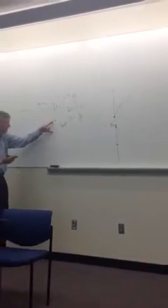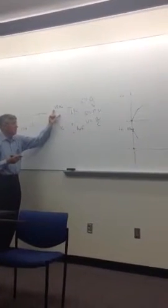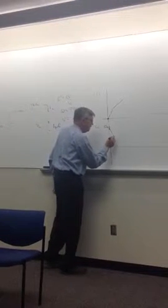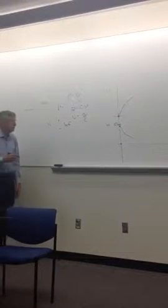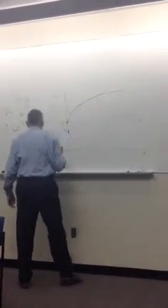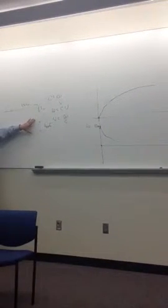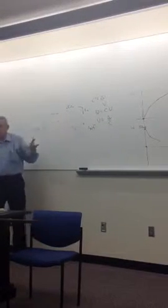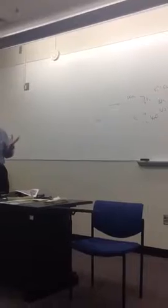But the voltage still did increase, therefore there is a decrease in the voltage across the resistor, so the current will decrease. But again, it's not going to decrease as fast. And this is going to continue on with the voltage going up until we hit 10 volts here. If we have 10 volts, then 10 volt rise, 10 volt drop, there's no voltage across the resistor. No voltage across the resistor, that means the current is zero.